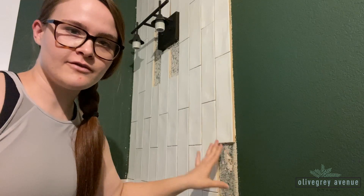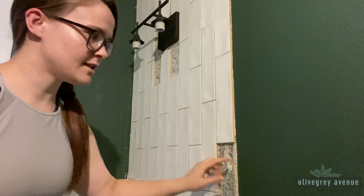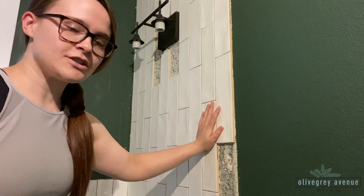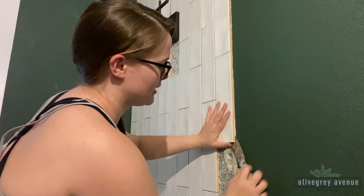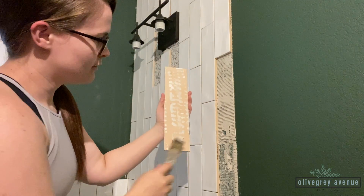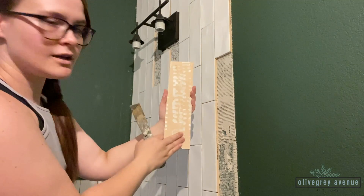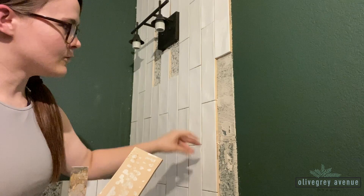Let's look at what happens when you don't use the proper amount of tile adhesive or press it on correctly. I found out after the fact that a tile didn't line up with the bottom of the vanity — I'd started the tile six inches up rather than at the very bottom, so it's slightly off. When I tried to pry it off, it popped right off easily, showing I hadn't used enough mortar or pressed it in firmly enough. You could still see the ridges on the adhesive and only a couple of contact spots. When I redo it, I need to press it in more.